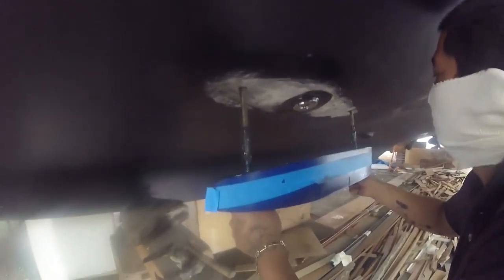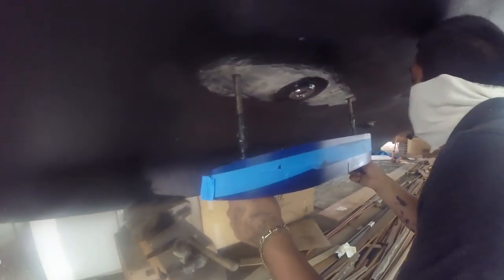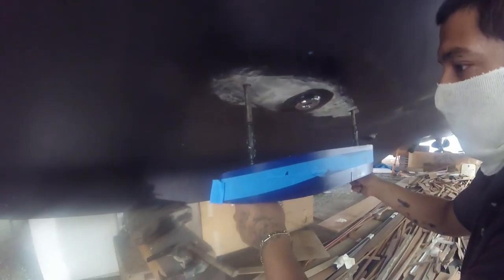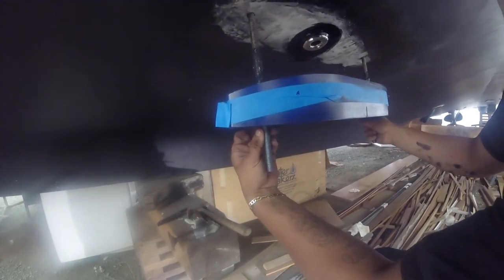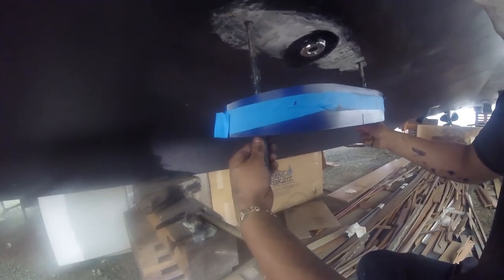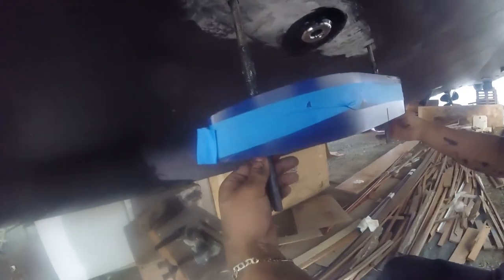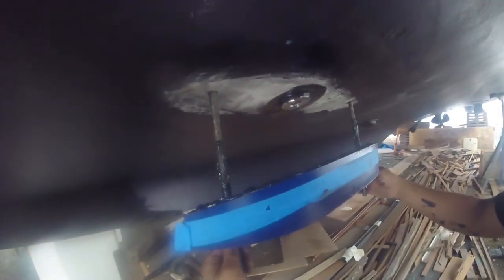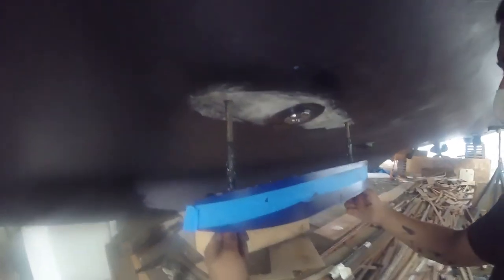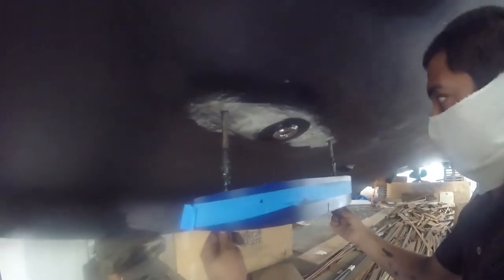Okay, we're in position now. We've got the threaded rod marked 4 inches down on each side, and we have our bolts screwed 4 inches up. That'll give us room to put the transducer on. We have a bunch of caulking on the threaded rod inside the fairing block and enough to go up through the hull. We have a guy up top with his own caulking gun and the other side of this.